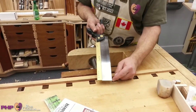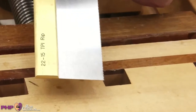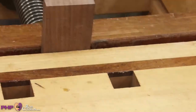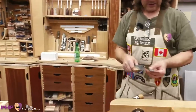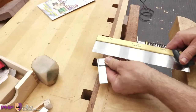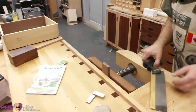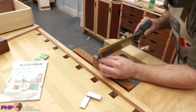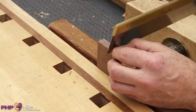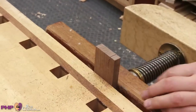So when I developed the saw, I put the first 2 inches, little tiny teeth, that's what the 22 means, 22 teeth per inch versus 15 back here. And the angle or the face of the tooth that does the cutting, instead of it being perpendicular to the run of the blade, meaning this is an exaggeration of the tooth, the face of the tooth, these little ones up here are leaning back like that. So because they lean back, they offer very little resistance. So it allows you to go in by pressing against your thumb and finger. It allows you to do that without any effort, and just enough to catch your thumbnail. Well, what that allows for is the track for your saw to stay in, so when the big teeth engage, it cuts nice and fast.